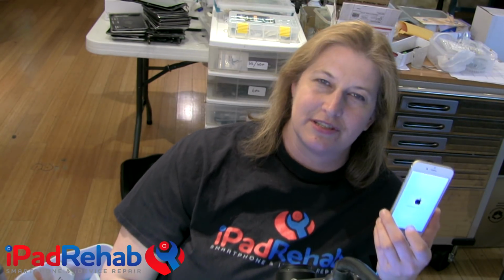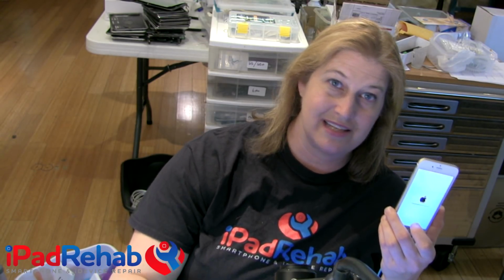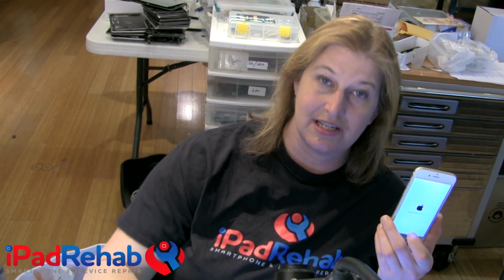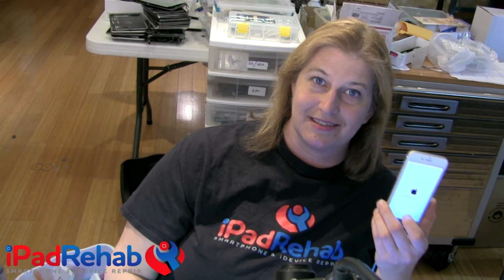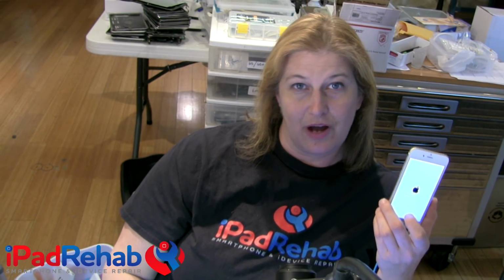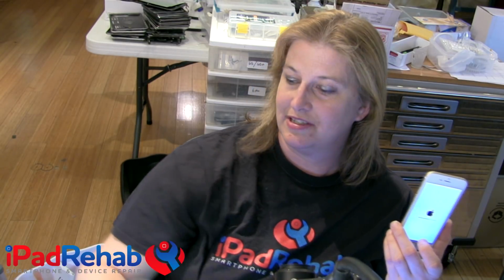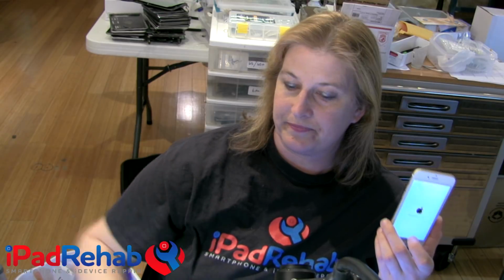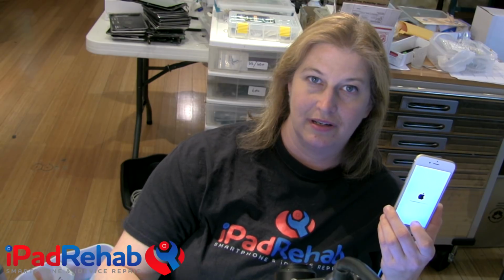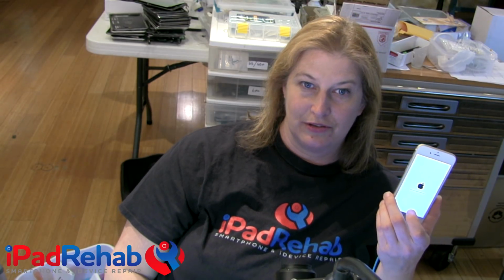And there's a lot of cool things that you can do. It turns out not all of that top layer SD-RAM is necessary. So you can drill out chunks of it and get down to the die of the CPU and run jumpers. There's some folks that are doing that to solve a couple of different problems. And I'm a fan now. I'm going to try one of those problems the next time I see an error 14 phone that comes in that is missing continuity between a pad under the CPU and some resistors by the NAND that it goes to.